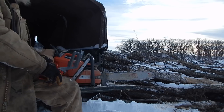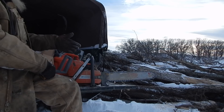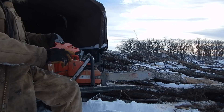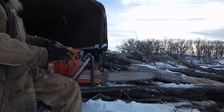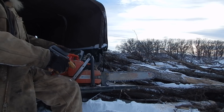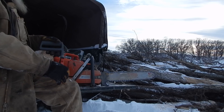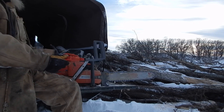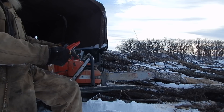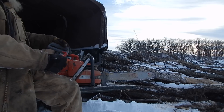I'm always looking to buy a 51 or 55 for parts, and unless they drop a tree on them this cover is usually fine. The normal thing people do is seize them up - run a bad mixture and cook the cylinder. You can buy replacement cylinders out of China too, but it's not something I like to do with a saw I use a lot. I really have my doubts about this one though. This was $19 shipped from China, but I think you get what you pay for - and this plastic is not going to handle low temperatures.